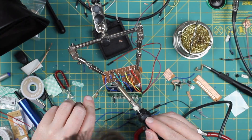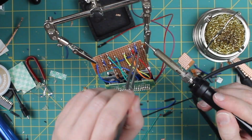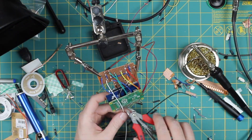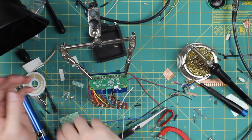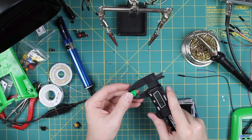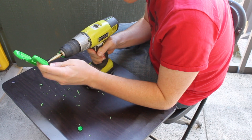Now that the screen module and the Pi are married, I need to ground all the buttons to a common line — I'll run some ground lines, create a couple of buses, and connect all of that to one of the ground pins on the GPIO. For shoulder buttons, I'm going to use these little candy-color tack switches that'll fit right into the top of the shoulders on the bottom of the case. I measure the button cap — about 11 millimeters — then grab my stepper bit and get to chewing through the plastic.